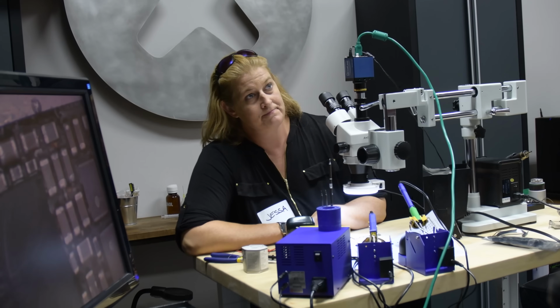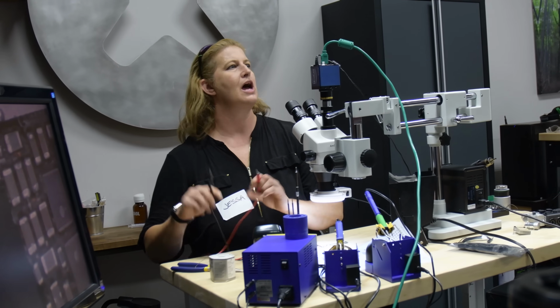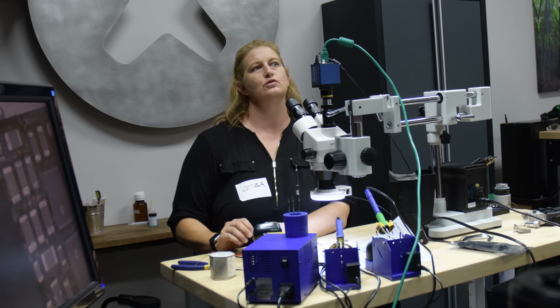So let's think about this. This trips up all kinds of people all the time. This is the number one misconception in board repair. On most of the lines in the iPhone or in the iPad, we would be able to come up with a relative measure of the overall resistance of the line to ground. Resistance to ground.